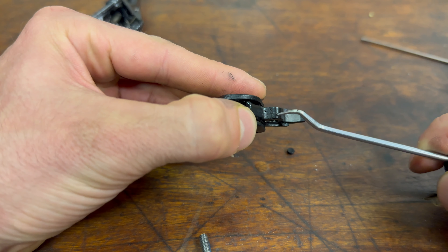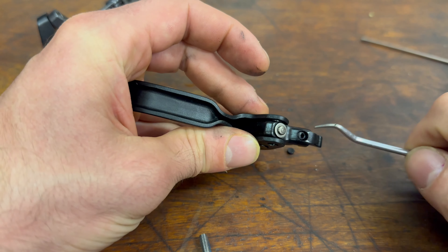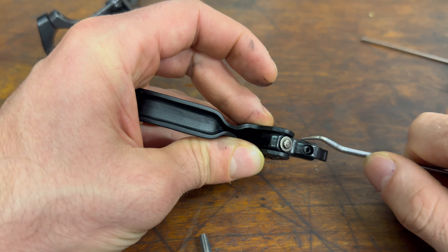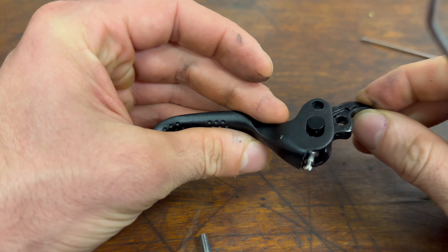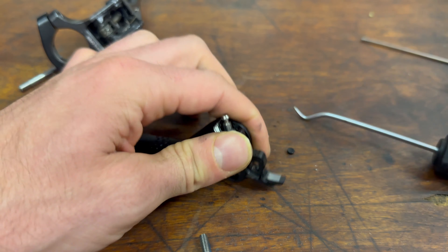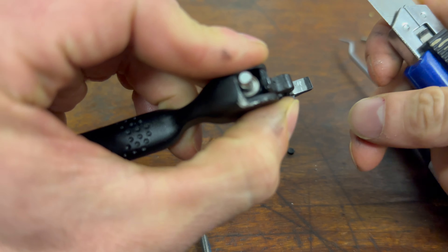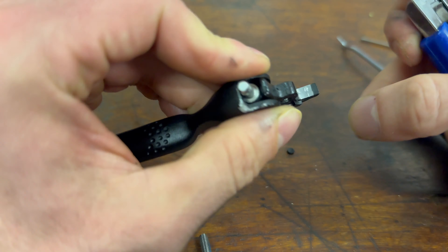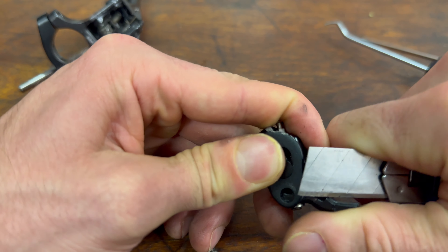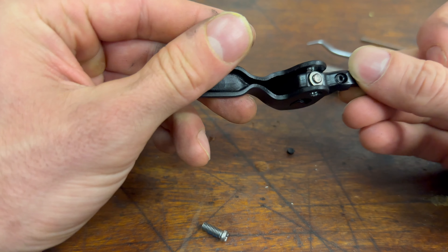This one looks like it has been forged. Probably this surface was machined afterwards, because you can see here how rough it is — and here it is totally smooth. You can also see here some kind of telltale mark where the tooling has been made out of upper and lower pieces. The material is probably steel. I don't have a magnet here to try whether it is ferromagnetic or not. It's harder than aluminum, I think. Otherwise, quite nice.